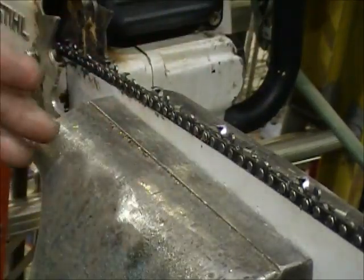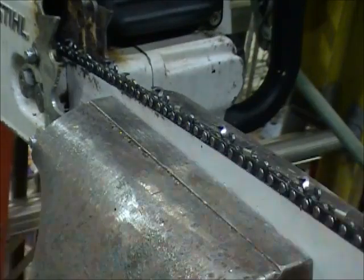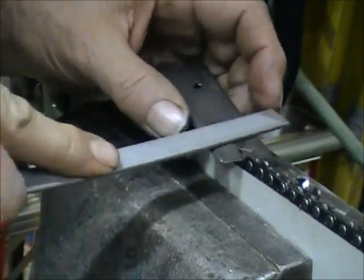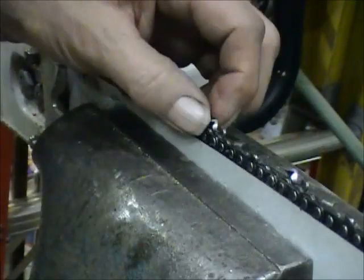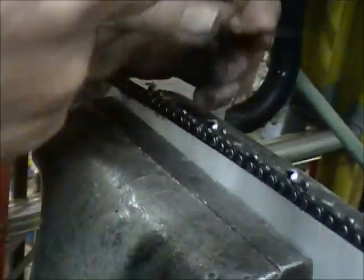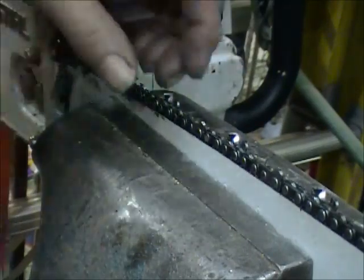You can't have a saw with all this extra safety stuff on the chain and still use this tool. But if you know what you're doing with the saw, most times you don't need that stuff — you just have to be careful with the tip of that bar at all times. This just lays on here and your depth gauge sticks through it. About every third time I grind my chain I take the depth gauges and use this. You just lay it on there — you don't even have to hold it anymore. Your saw chain has a little wiggle to it so you have to account for that. Once you get this in place your file is holding it down, and it rubs from the tip here down to the cutter. This is the best tool there is to do depth gauges — it just works fantastic.